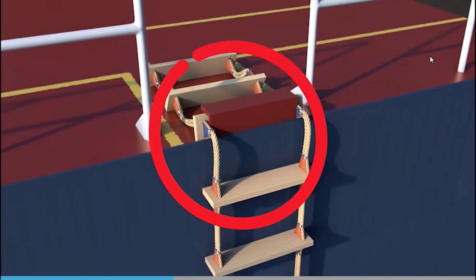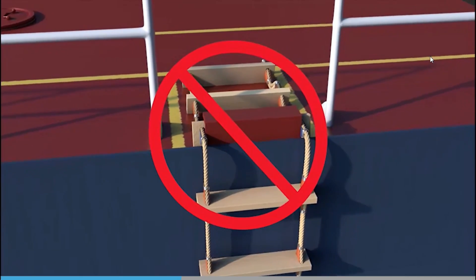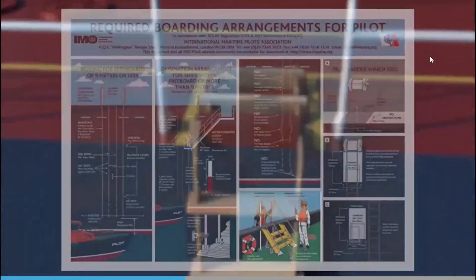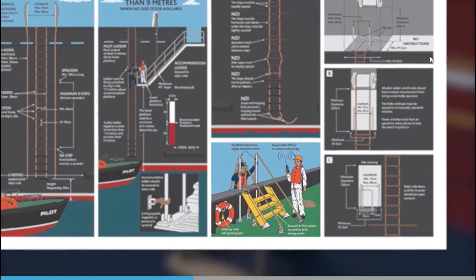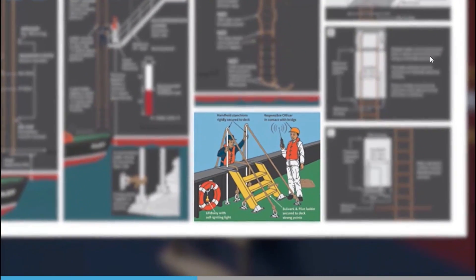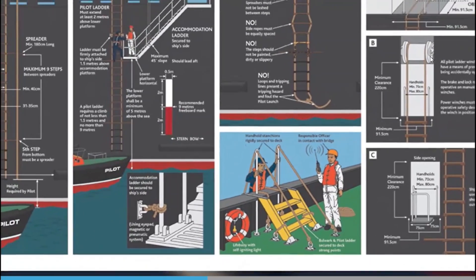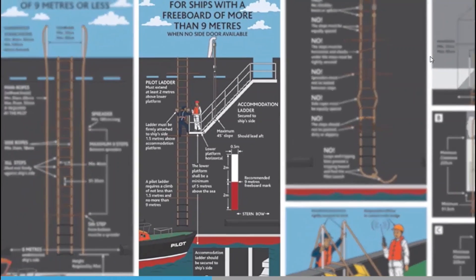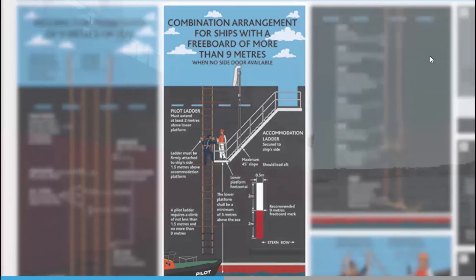It's not acceptable to rely on a spreader resting against the inside of the ship's rails, or by placing a step under a hook-shaped plate. If the ladder rises over a bulwark, make sure there are bulwark stanchions fitted and a well-secured bulwark ladder giving access to the deck. It is common practice to rig the accommodation ladder in combination with the pilot ladder.